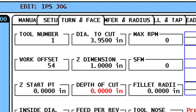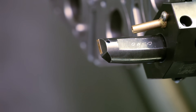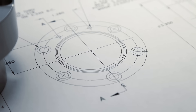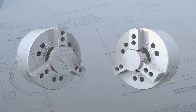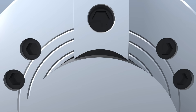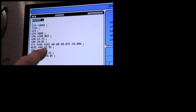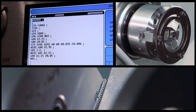Cutting our bore to 1 inch deep will give us more than one third part length grip. We set the remaining values conservatively based on the insert we're using to cut these steel jaws. When boring OD gripping soft jaws, cut the inside diameter of the jaws to the nominal workpiece diameter. In our case, the blueprint shows a diameter of 3.950, so we will bore to 3.950 inches. Undersized jaws will grip along 6 edges, whereas oversized jaws will grip only along the center of each jaw. Our program is set to cut at the nominal part diameter. The soft jaws are clamping inwards on the boring ring at 100 psi, which matches the direction and pressure we'll use when cutting the parts. The master jaws are at the center of their stroke. Now we're ready to cut these jaws.